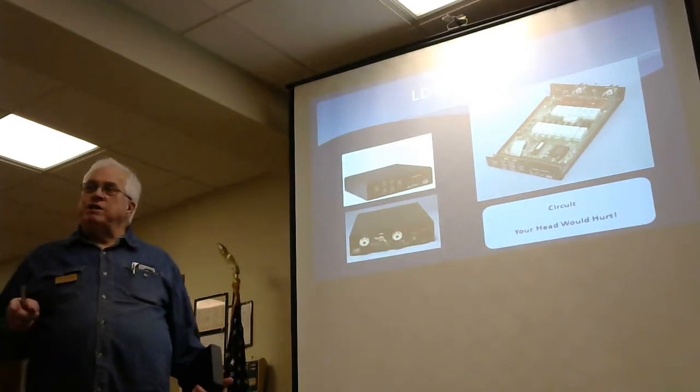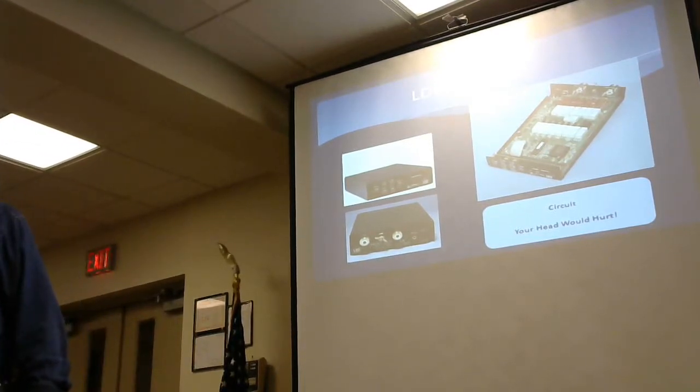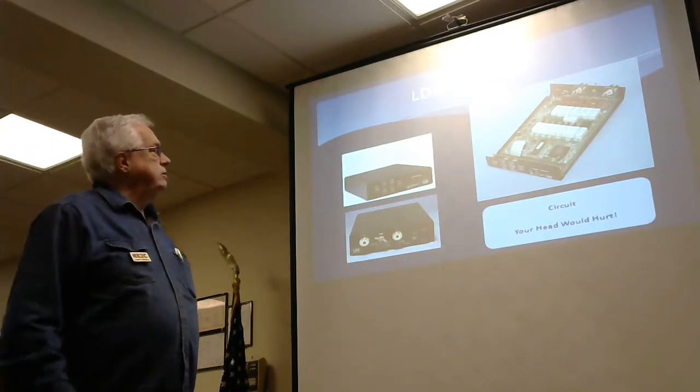And when one of these things starts tuning for the first time and it doesn't know what it's looking for, pretty soon lights will start to come on, and there you are. And then it will remember that antenna. It'll remember what it saw the next time. So you change frequencies, come back, hit it, boom, it'll be right there. Okay, next.